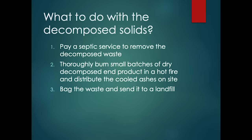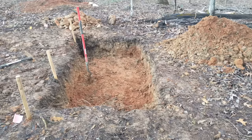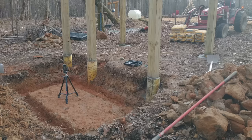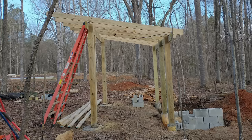These last few minutes are a narrated slideshow of the construction process. We started in wintertime by clearing saplings and trees and marking the location of the 6x6 posts. Digging the decomposition chamber was the first major task, done with a mattock and shovel. I used concrete forms to set posts 3 feet in the ground, used a laser level to get the footer trough level, and mixed and poured bagged Quikrete for the footer. Six-inch cinder blocks were laid out to verify the footer design was correct.